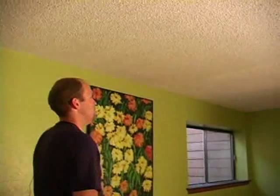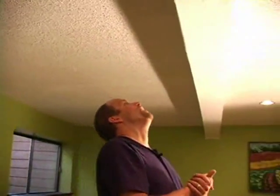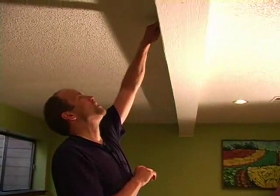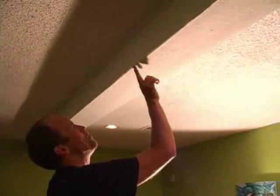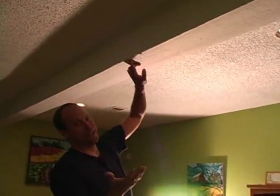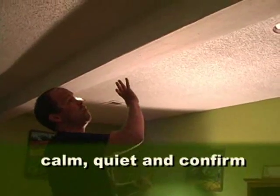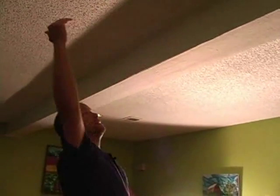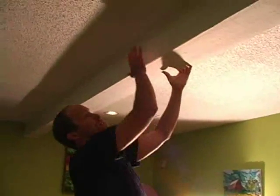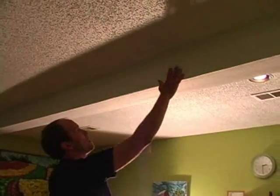Right here I really don't see anything visually at first — no water marks, no water stains, no water damage. Correction: there are water stains right here. There's a brown water streak here and a water mark here. There are three things I do: I try to be calm, be quiet, and then confirm before I say a word about any water or make any conclusions about water penetration. This is probably where the exterior wall is because of this load-bearing beam, and this is where the slider door is — an original 25-year-old slider door that probably has flashing problems and sealant problems. Could be the roof, could be the deck.